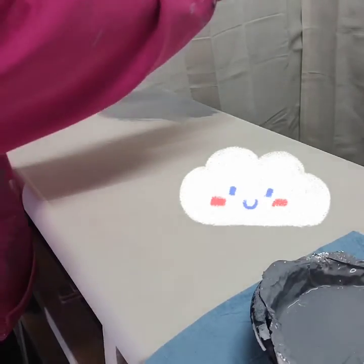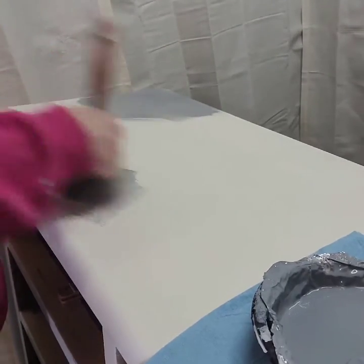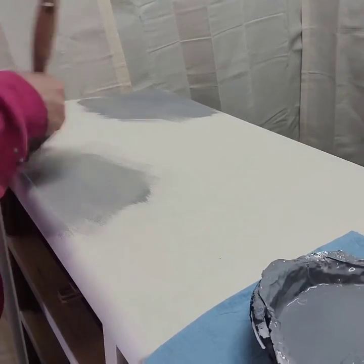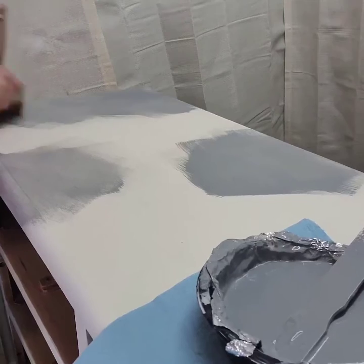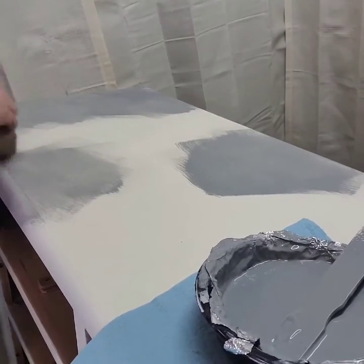Limewash painting is all about creating clouds. Maybe that's why I'm drawn to it. After dipping my brush in paint and misting it, I made the clouds by using a crosshatch pattern to form circle-ish, if that's a word, shapes in random sections, eventually blending them together. So each area ends up drying at different times, giving you that blotchy yet blended effect.